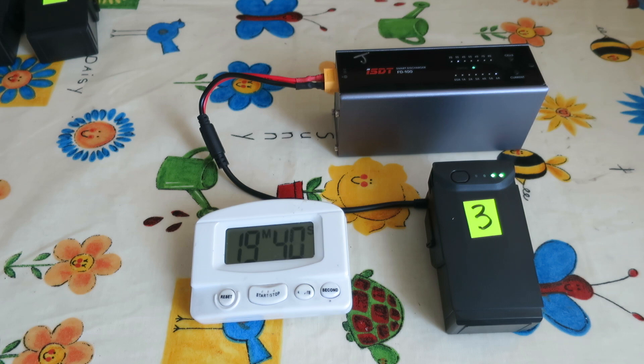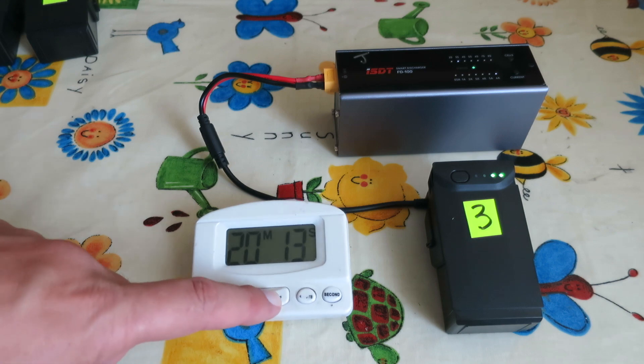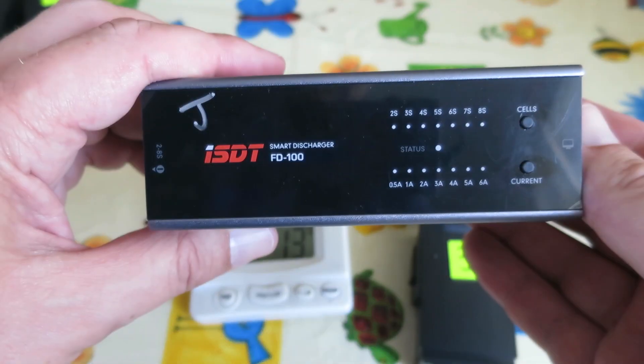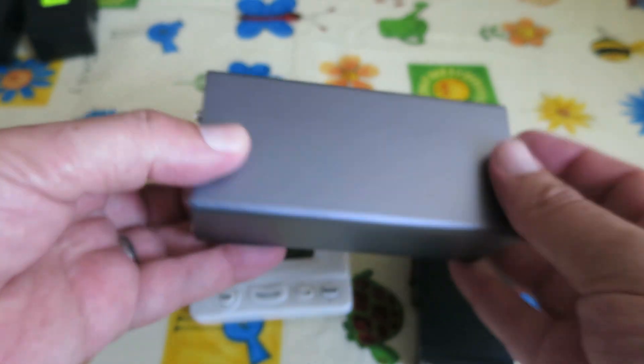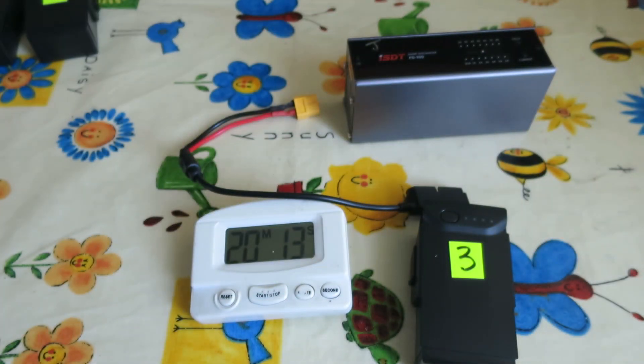On 6 amps it finishes in just under 20 minutes. These batteries were 100% full — I charged them yesterday and didn't get around to flying, so I just wanted to run them down. I'll put a link below to where I bought the discharger, but any discharger will work. The main thing to look for is one that handles a decent wattage — this one is 80 watts, which is 6 amps at a 3S pack. Some chargers can discharge but take a very long time because they're very low current, sometimes only half or even a quarter of an amp, which would take a few hours per battery and isn't practical.